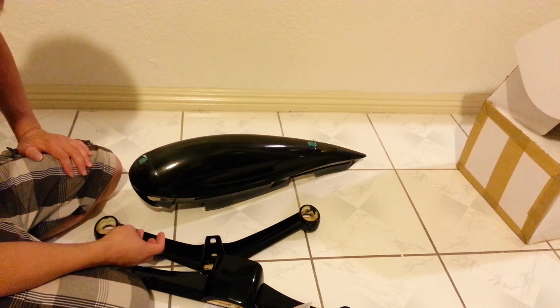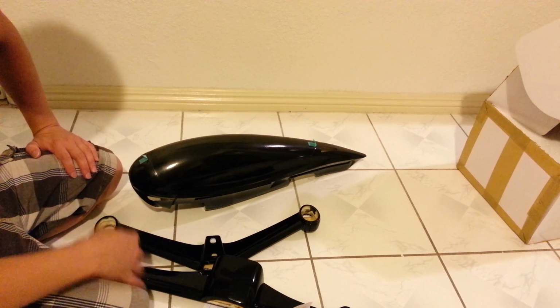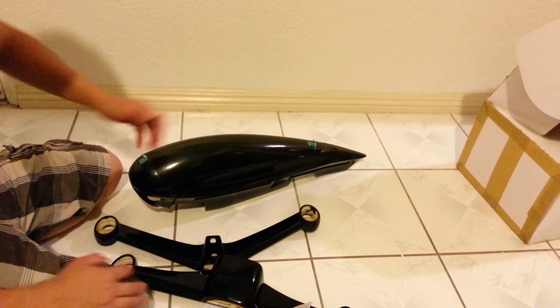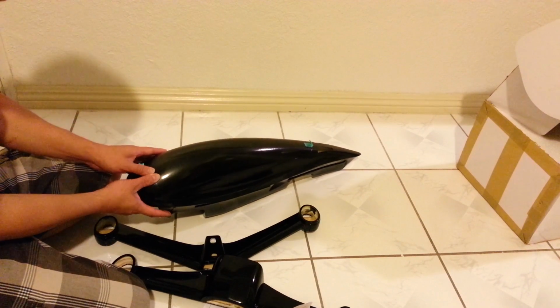With the motors, it's another 4 motors, going to be about 400 grams, not including the wiring, adding the ESCs, battery, flight controller, all the gear. It's going to be about 2,000 grams from what I'm estimating.